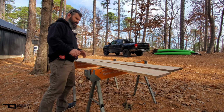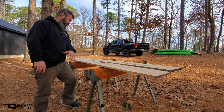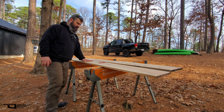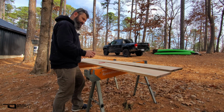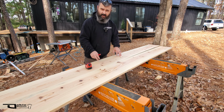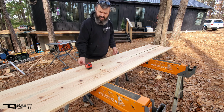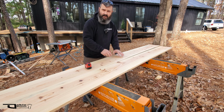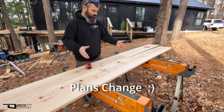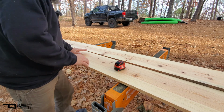I'm gonna make my bench top out of these two pieces. I'm gonna need somewhere around 17 inches or so overall width. What I wanna do is figure out where the most pleasing grain is, or the most interesting grain is, and I'm gonna go ahead and mark these for orientation. I will roughly cut the length. I'm gonna give a little bit because when I cut them, they're not gonna be square and I still need to fit them into the final location. But I also wanna reduce their length for further processing, meaning getting the sides parallel to one another, because I am gonna try to glue these up without a jointer. The design is gonna be, we're gonna have two doors that flip up, one here and one here. We have surface mount hinges.